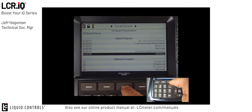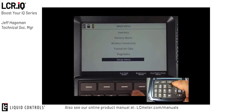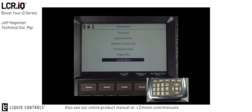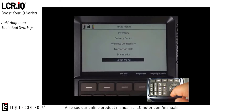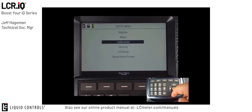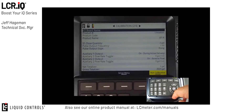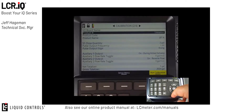Now I can scroll back to the main setup menu and then back to the main menu. When configuring the calibrated pulse output, there are a few additional parameters that can be set. To reach these parameters, go to the setup menu and then to the calibration menu. Once in the calibration menu, scroll to calibration screen 204. All the information in the calibration menu is product specific — you can see on product number one. If you have multiple products, you would need to set up frequencies for each one of the different products.